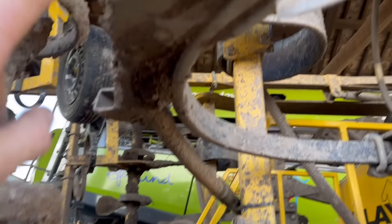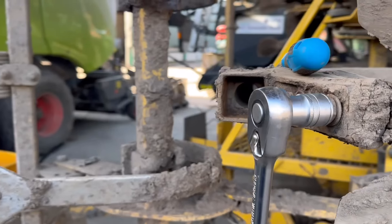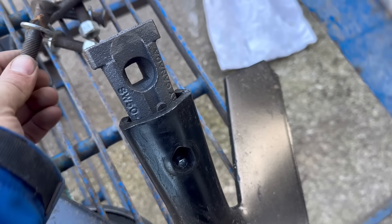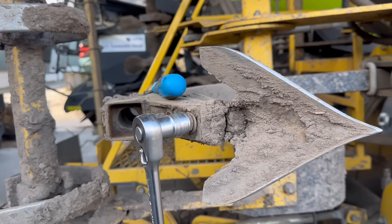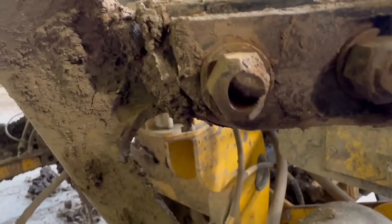So I'm just stealing this off the Claydon. I've removed the seed boot, then I'm undoing the bolts to release this peg - pop this pegging and pull the foot off. The quad track's in the field so I'm having to put pressure on there as I undo it so the bolts stick in the square hole, because they've got a square in the foot and a square on the back. They've come loose a little bit, so a bit of messing to get it off. I'll take that off and maybe one other side at an easy height, and we'll stick them on the other cultivator.